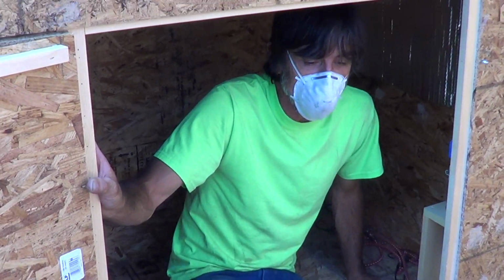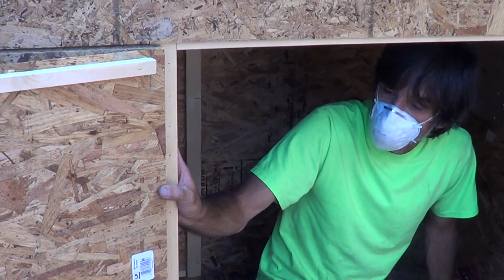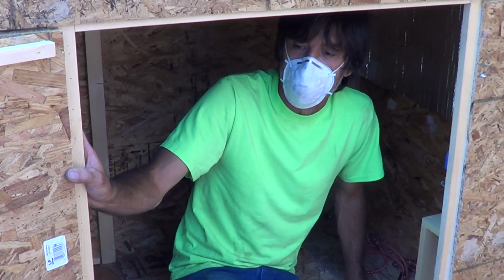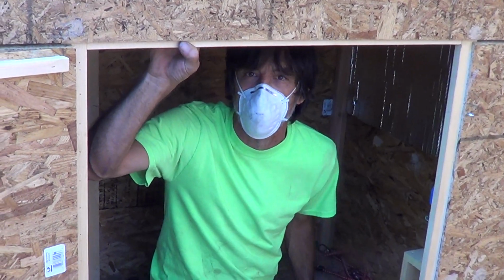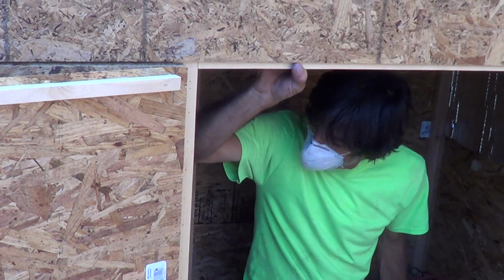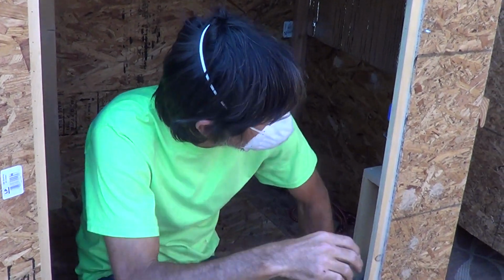It's exactly that. The OSHA requirement for carbon dioxide level is 5,000 parts per million, I believe, and this comes in at 2,000 parts per million. So this is well under the OSHA standards for workplace ventilation. And I think that's about it. It's on wheels, so you can move it and you can lock the wheels.